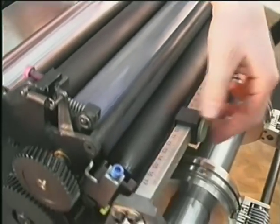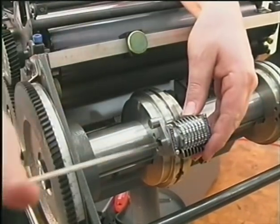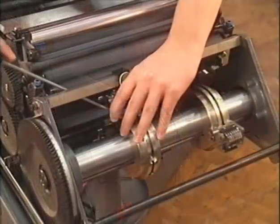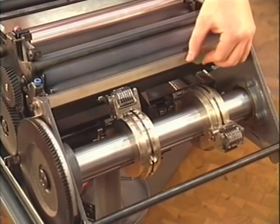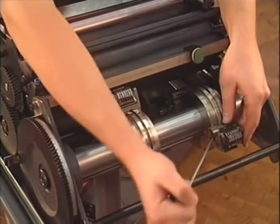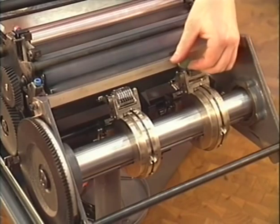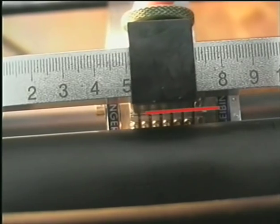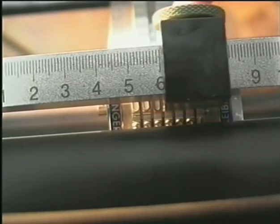The caliper gauge is moved above the mounting rings. All numbering boxes are now vertically adjusted and fixed on the mounting rings. Their correct positioning can be checked with the caliper gauge. The vertical position of the numbering box is correct if the caliper gauge is in one line with the lead edge of the digits.